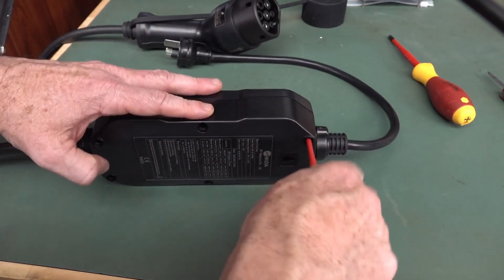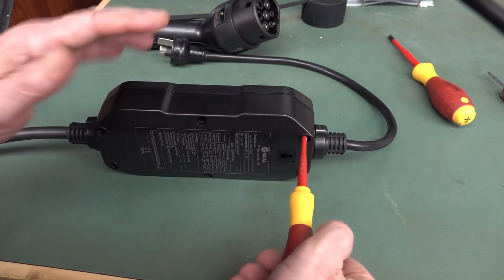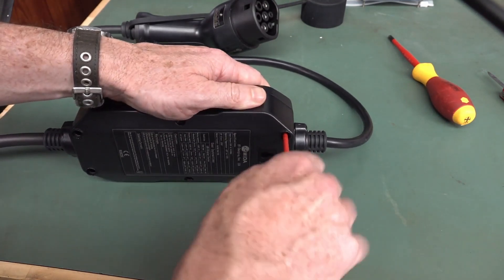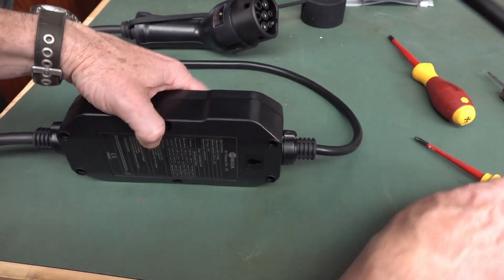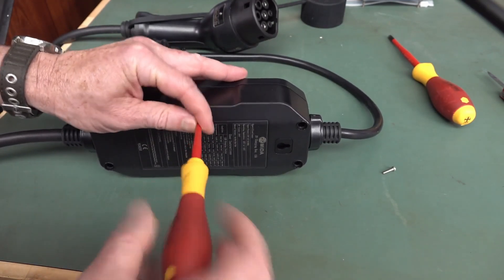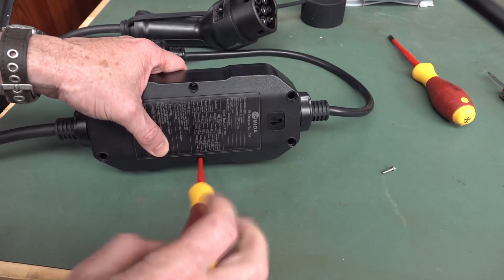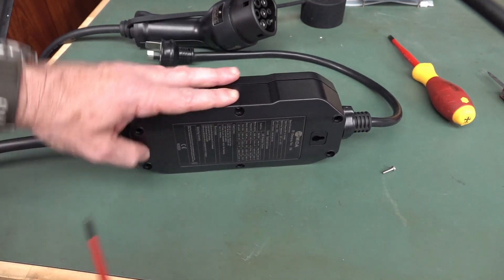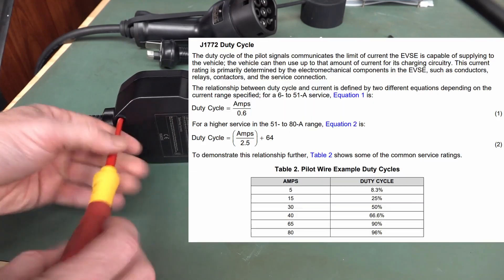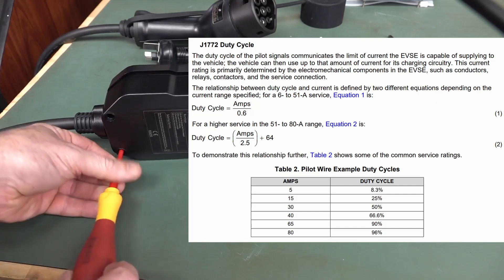This is not a charger, okay? There's no active circuitry inside here that charges the car. The charger is actually inside your electric car, at least for AC charging. For the really high-power CCS DC chargers, they charge directly into the battery pack, and that's why they have to be hugely complex and expensive things installed at a service station. But for AC chargers like this one — up to 7 kilowatts, or even 22 kilowatts depending on whether it's single or three-phase — all the EVSE does is switch through. It's just got a big relay that switches through the AC, and a little micro which sends out a PWM signal to the car to tell it what charge current is available, and then the car will actually regulate that.